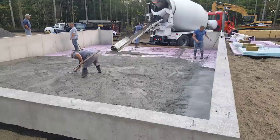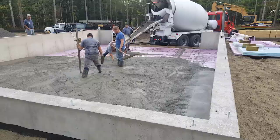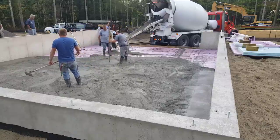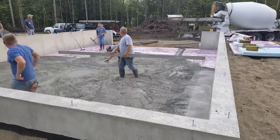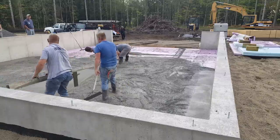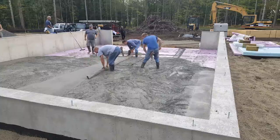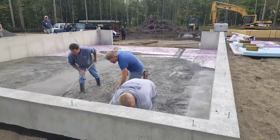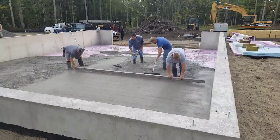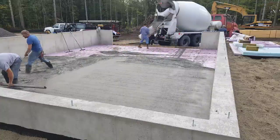So you can see we're going to be shooting a wet pad. This is how we screed a lot of our concrete — we do it with these wet pads. We'll make a pad in the concrete the same level as the outside edges, check it with a laser, and then we'll put a little X on it when it's perfectly to grade. Then we'll strike a wet pad in the middle to do our straight edging from. We're going to kick screed this floor instead of using our Vibra screed. We'll just kick screed it — it's just as fast for us. You definitely need two guys; that's a 14 foot straight edge. By kick screed I just mean we're not stopping and pulling — we're kind of kicking and filling in our boot tracks as we're moving backwards.